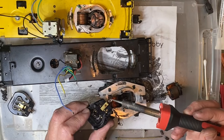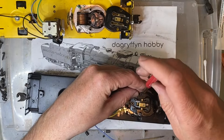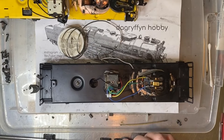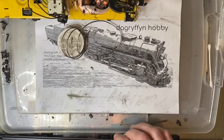As you gain more experience doing diagnostics, you need to spend less time swapping parts because you'll have a better understanding of how everything works. I put the armature back in with some brushes. The process of swapping out parts brings you down to hopefully the part that's actually causing the issue. Okay, those wires are on — let's get the test track back over here. So we're back to the original motor, we swapped the brush plate, and we are still having the same issue.